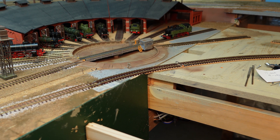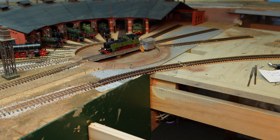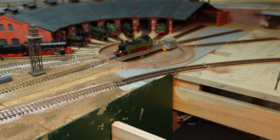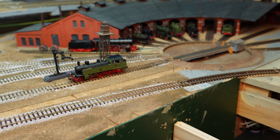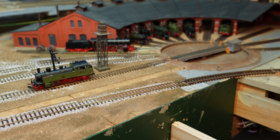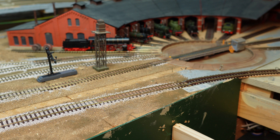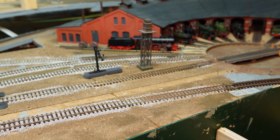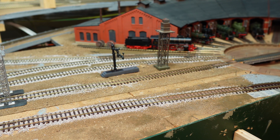Here's the portion of track I've shown. Up here we've got the little T5 coming onto the turntable — it'll turn on the turntable and go to the out track. When the front wheels pick up some current, they'll fire off the occupancy detection. So in five seconds you'll see the crane start to actuate. I'll push the buttons within Train Controller and then move the locomotive forward to adjust where it needs to be to fill up with water. Then we'll blast the little horn and drive off out of that block. Once the T5 is out of the block and occupancy detection is no longer active, you'll see the water crane wait another five seconds and then go back to its home position.